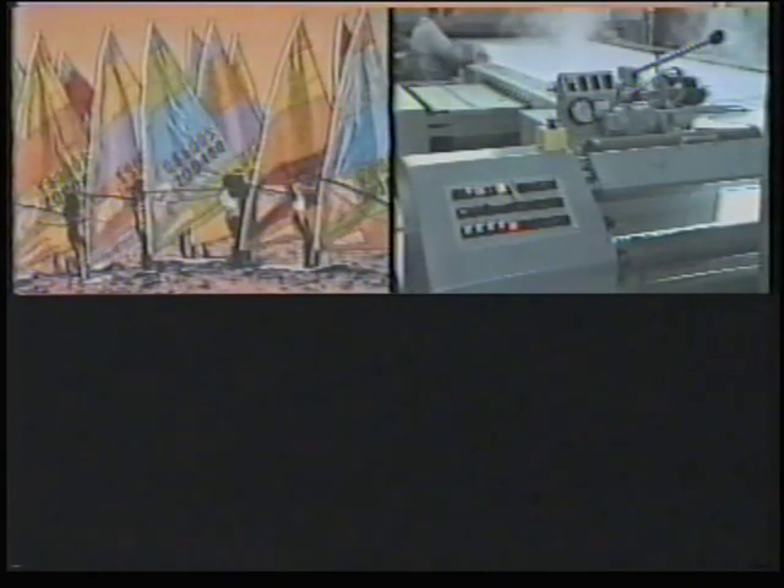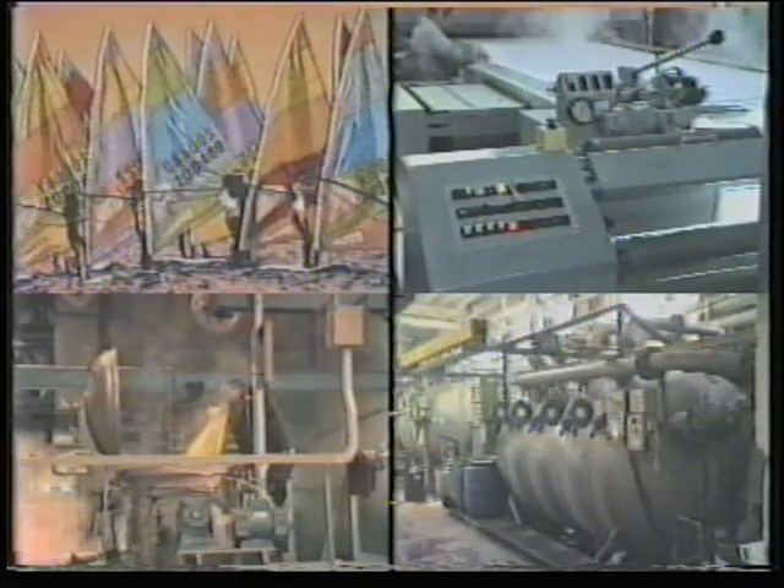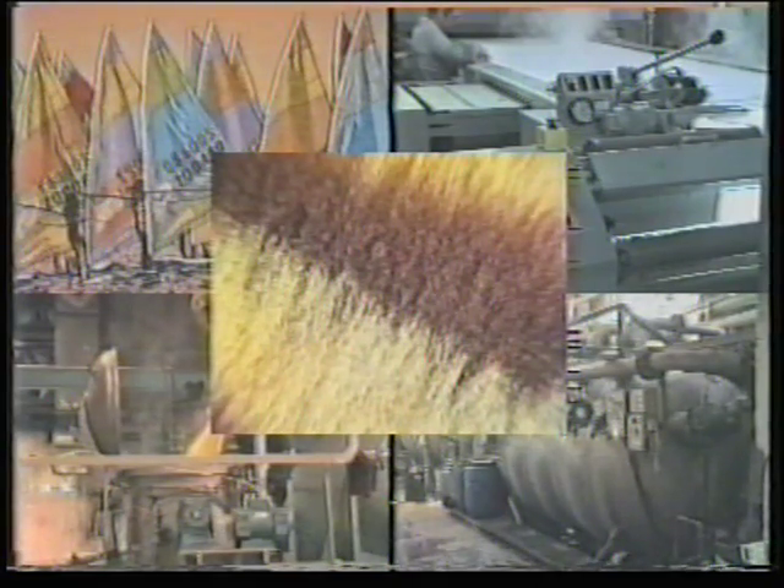In summary, we can say that colour is life and is vital for the individual and the knitting company. The preparatory processes before dyeing are mainly scouring and heat setting. Garments are treated either as individual items or put together in mesh bags and processed in batches. Because of their quite different geometry, fabrics are pulled or forced through dye liquor, very often in enclosed vessels operating under pressure. Finishing is carried out to modify and enhance the appearance and properties of fabric and garments.